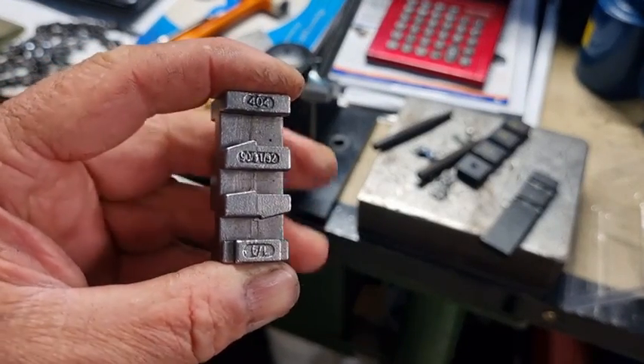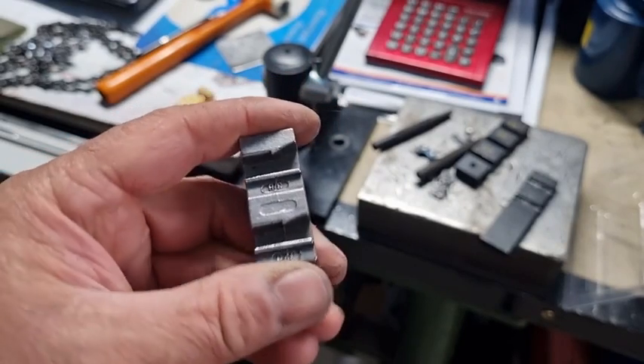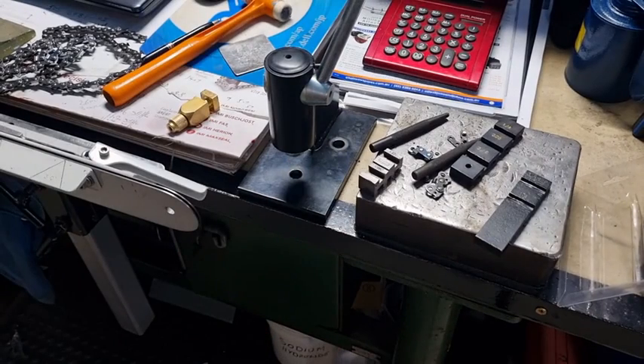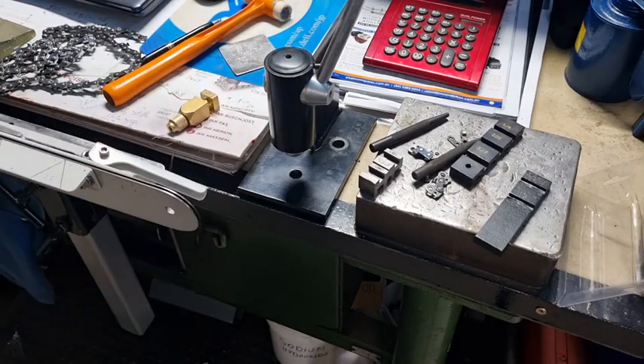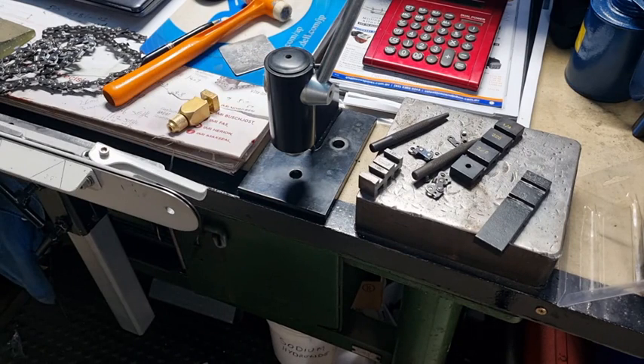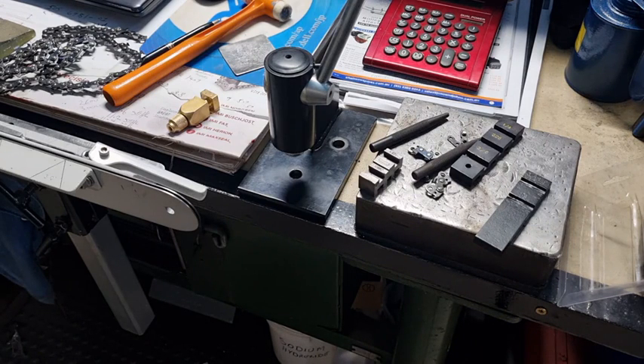There's another little vice out there on the market you'll see on eBay, but I'm not a big fan of those — they work but are a little bit fiddly. That's why I like the adjustable type, because you can't make a mistake with the adjustable clamping mechanism. That's about it — breaking a chain is simple. Do yourself a favour: pre-grind the rivet heads. If you don't have one of these chain breakers, you can grind the heads with a small angle grinder, then break them with a ball-peen hammer — just tap around the new master link. Very easy and minimal cost. Just remember: grind the heads off — easy peasy. Thanks for watching, give us a thumbs up, bye for now.